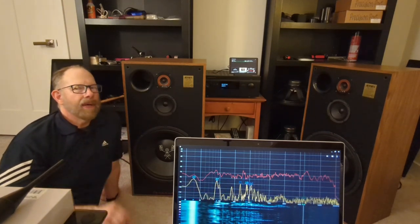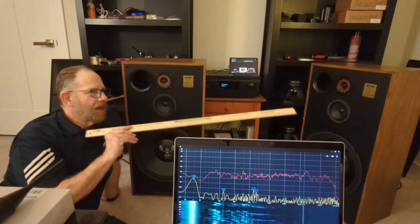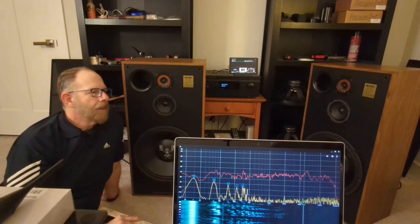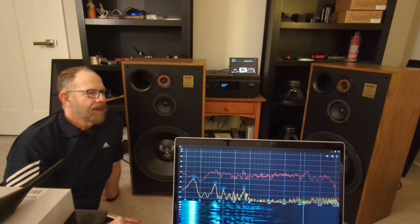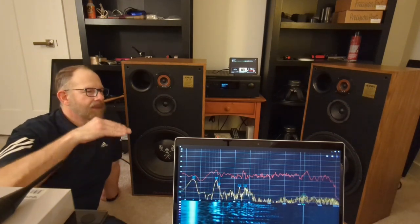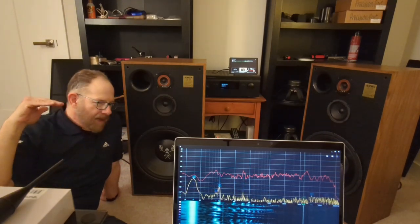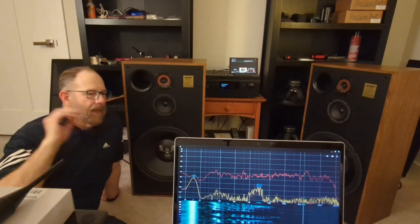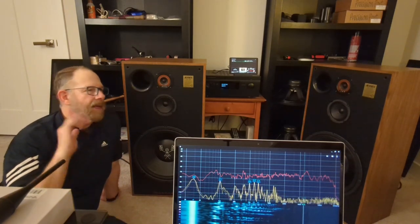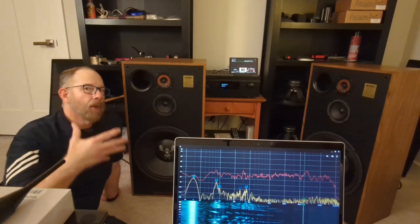So my hearing range and the frequency response for these speakers that I want to get nailed is that area that I can hear in. So from about 40 hertz is a nice bump. That's where a lot of loud bass comes in. It sounds really good. So ideally from about 40 hertz to, say, 12,000, I'd like it really nice. Above and beyond that, subsonic, and then in the high frequencies, I think personally it's more important that it can go lower.